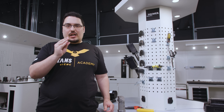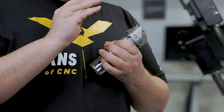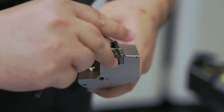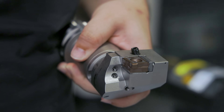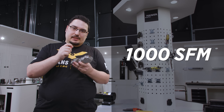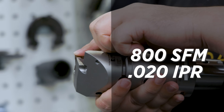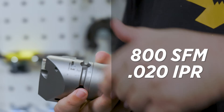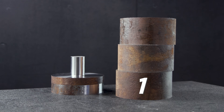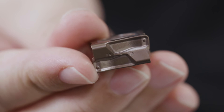After checking out some of the comments in that video, I thought it would be a good idea to revisit this tool. What we're going to focus on in this video is tool life. We ran it before at 1,000 sfm, but I'm going to dial it back a little bit and run it at 800 sfm with a feed rate of 20 thousandths inches per revolution. We're going to try to get three parts out of this tool using the same corner, the same insert, to show the longevity of the tool.